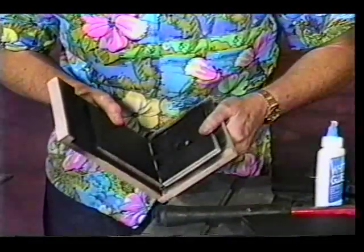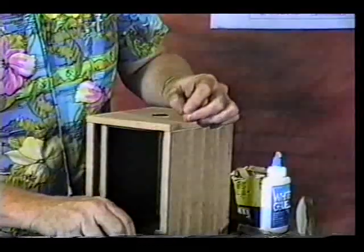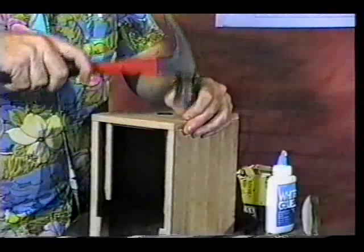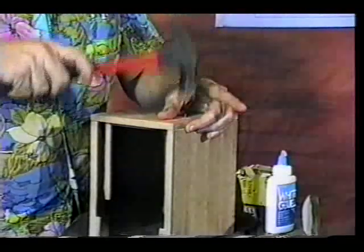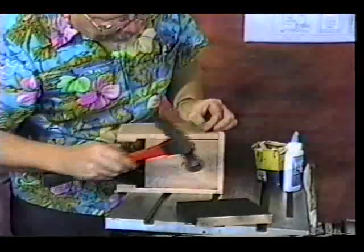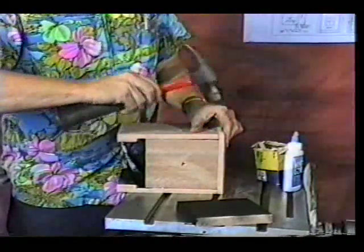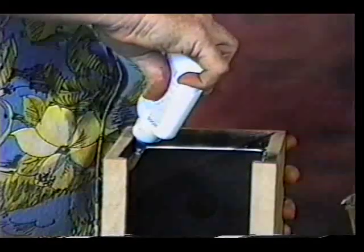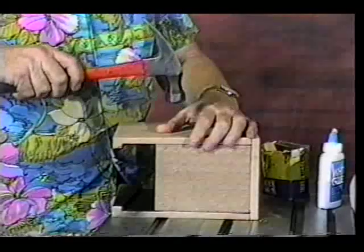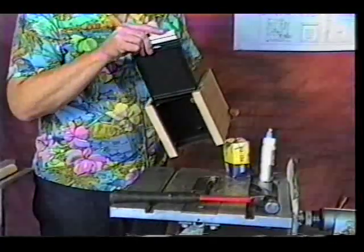At this point we're making the assembly. All the pieces are dry and we're just putting the camera together. We use white wood glue, or any type of wood glue, casein glue, and then we just nail it together. The joints, as you notice, all interlock and form a light lock to the camera. It gives you a good gluing edge. The camera's tight and strong — you could probably run over it with a truck if you wanted to. It's a very strong camera.